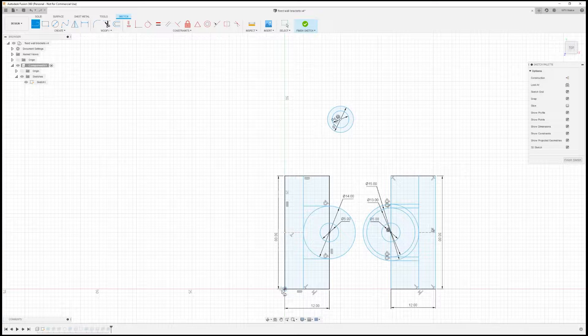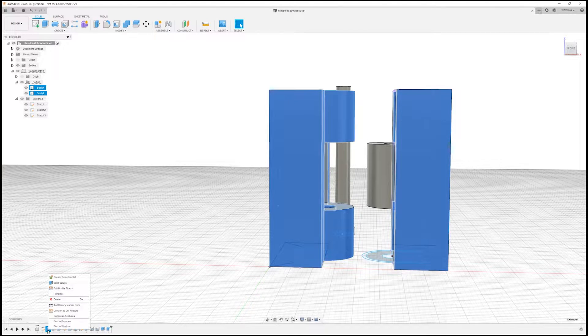Now we could finish it there — this part here is optional, not really required. We're going to do this at 45 degrees, so I'll press Tab and enter 45 degrees manually just to lock that angle. I'll bring that up to the edge there, do the same on the top. Fusion has already recognized 45 degrees — quite clever. On this side it did select 135 degrees and there we go, I've got it back to 135. We're going to finish that sketch — we're done there.